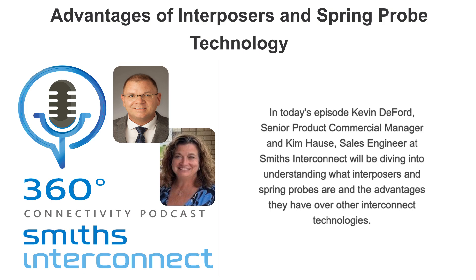With compression mounting, an interposer is mounted between two PCBs, which have other fixing methods or external hardware that compress the PCBs to each other, thus compressing the interposer. In some applications, the customer wishes to solder to the board directly on one side of the interposer — in this case, the probe's barrel is designed to have a land on it for surface mount soldering. We also have designs with a solid pin for through-hole soldering, or a solder cup can be integrated into the design for wiring in a connector application. Primarily, compression mounting is the preference for the advantages it provides in manufacturing.